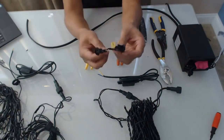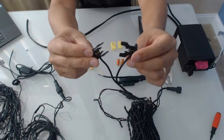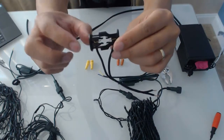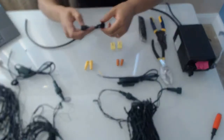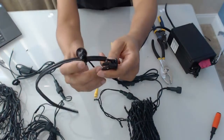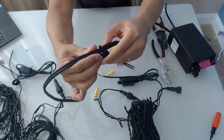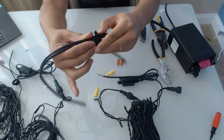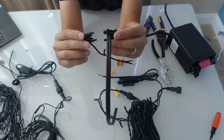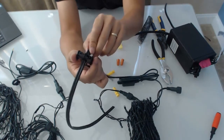This one works off of a pin system. There are pins in there - you can see the pins. The idea is to get these two pieces clamping into the wire. You place the wire here, push these two pins together, and it's going to puncture the insulation. These are meant more for 14 gauge wire. I have 12 gauge here - it's a little bit tight but it'll still work. You place one half like that and hook up the grooves, then just click these guys together.